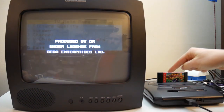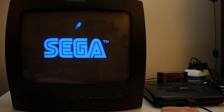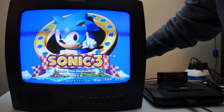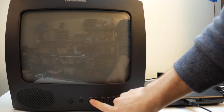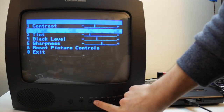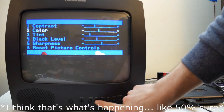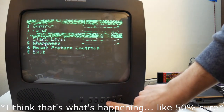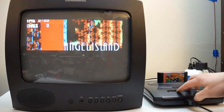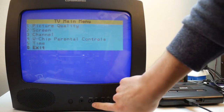If you still had some questions about what to expect if you do this — this is the on-screen display when it's enabled, then you trigger it on the TV, and then you inject the RGB signals over it. If I hit the toggle switch in the back to disable it, the screen goes blank. You'll still hear the sound, but if I toggle the on-screen display, the blanking signal says it's okay to only show the on-screen display. What I've noticed is the on-screen display draws black everywhere where the text isn't present, so the RGB signal is coming through only where black isn't present.